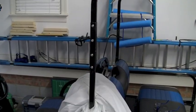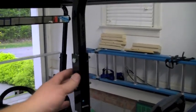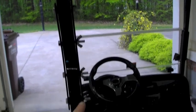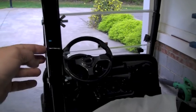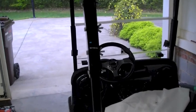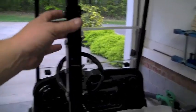The angle's cut. At this point I've made the cut, and it's important before moving on to the next rail that you go ahead and put your brace on and put your bolts that hold it in at the top and the bottom. On this cart I did something a little different — I put nylon washers in the spaces here on both sides. These are your pivot points, your top and your bottom. These are your pins with the wing nuts that keep it straight. I'm thinking the nylon will help it fold down and fold up easily. I picked those up for about 10 cents a piece at Lowe's. Before you go on to the next cut, go ahead and put your brace on and lock it in.